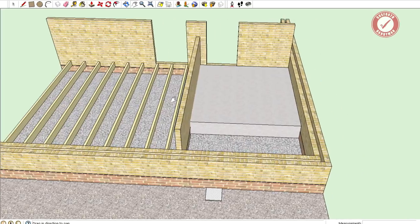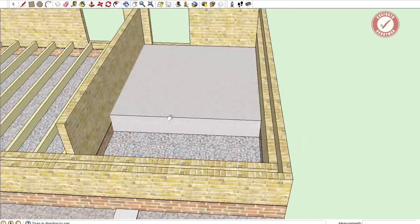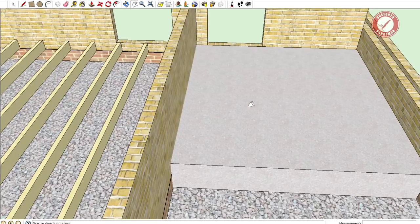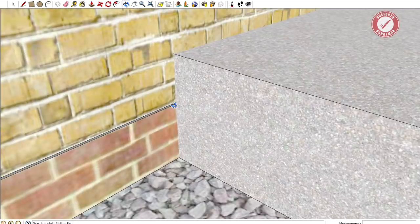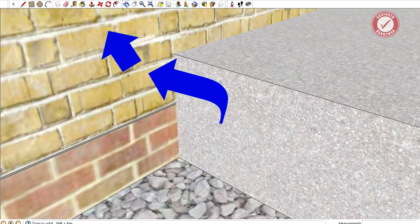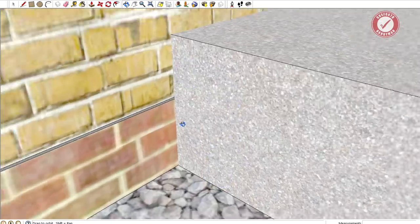The problem in this house - and it was a bit of a design flaw really - is that they'd installed a concrete floor in the kitchen. This was almost certainly original to the property, but this concrete floor bridged the damp proof course. This floor is at the same ultimate floor level as the joists, but look at where the damp proof course is. You must make sure that the DPC isn't getting bridged, because what happens is water from the ground comes up through the concrete and just goes around the damp proof course and into the brickwork further up, following the path of least resistance.